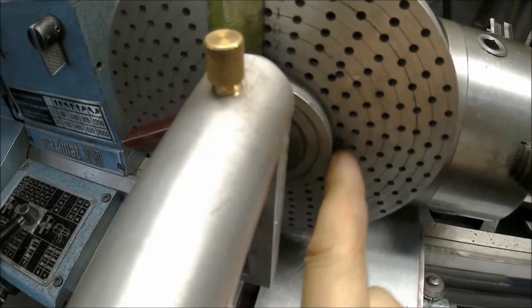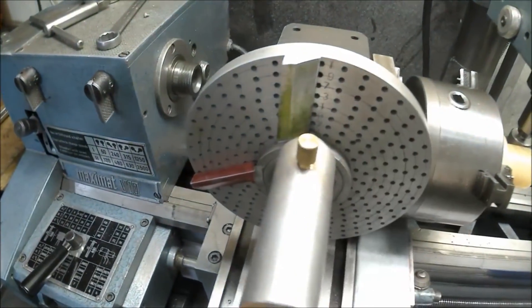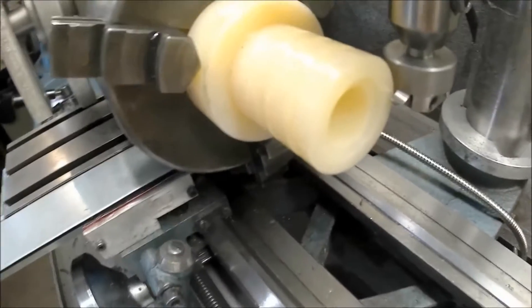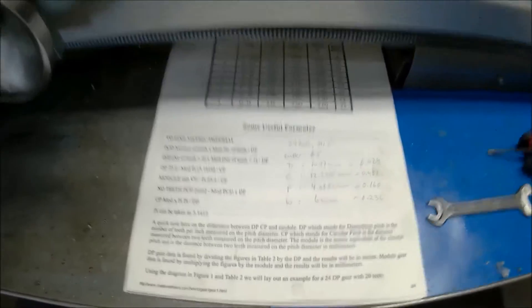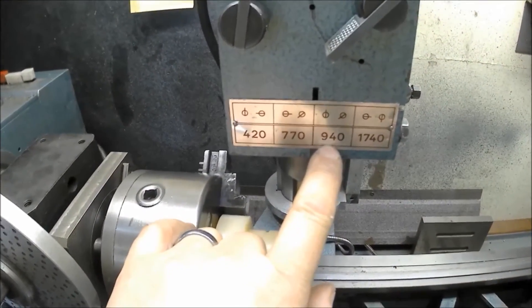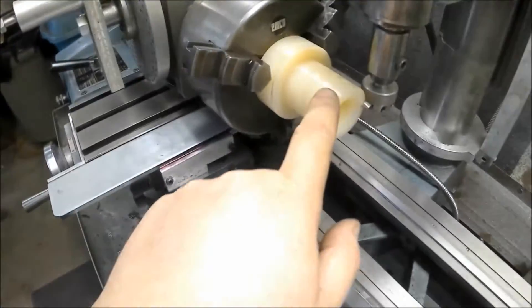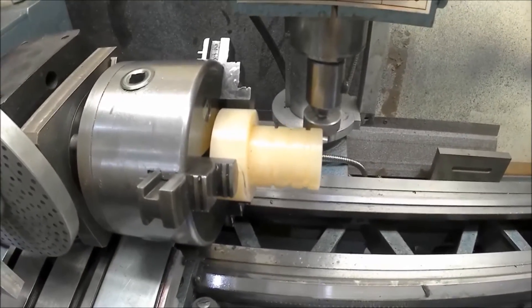There's exactly 16 holes all the way around to the red indicator arm. So I'm going to cut a gear, turn it one full revolution and 16 more holes, then move the indicator arm and do one cut. This is the bit that I ground up. I'm moving in 160 thousandths. I've set the mill gears to run at 940 RPM - it's probably faster than I should, but that's the only gear that works because I'm making a gear to replace the broken one. Since it's just nylon, I'm pretty sure it will be fine.